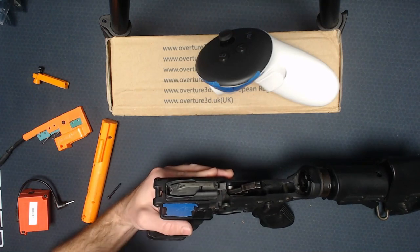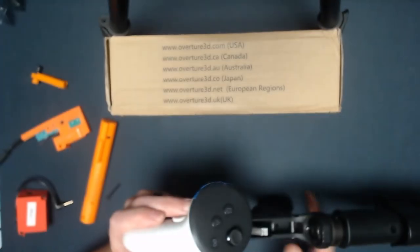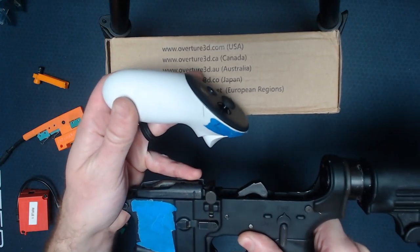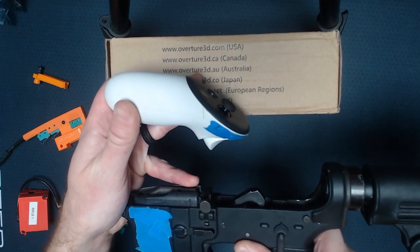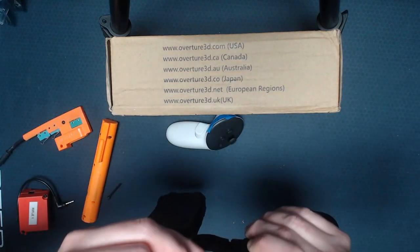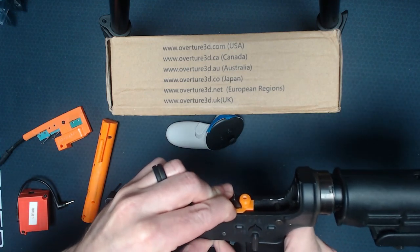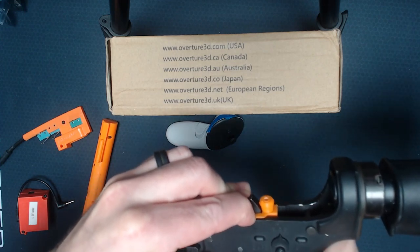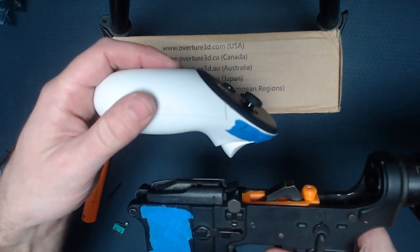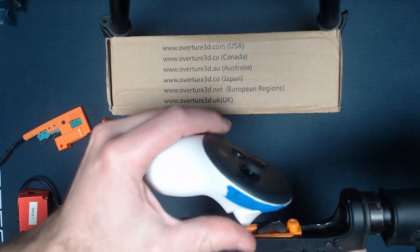The mock upper would still have a barrel nut so you can mount whatever handguard, though you'd need a separate one for this approach. The controller would be mounted in the same approach I used for the pistol, probably up around that height so a charging handle — a real one — can still move underneath. There'd be a connecting rod using a little insert in the lower, with linkage that goes up and moves the actual trigger. I'd probably need either more movement or use angles to multiply that small amount of movement into more trigger travel.